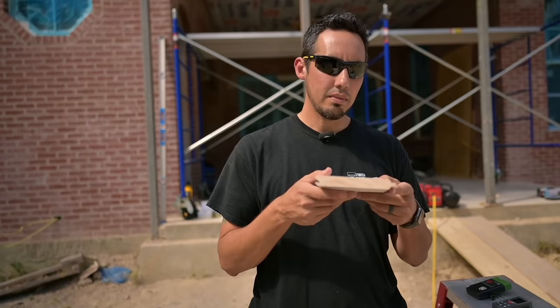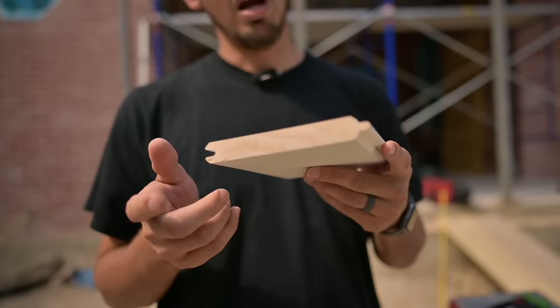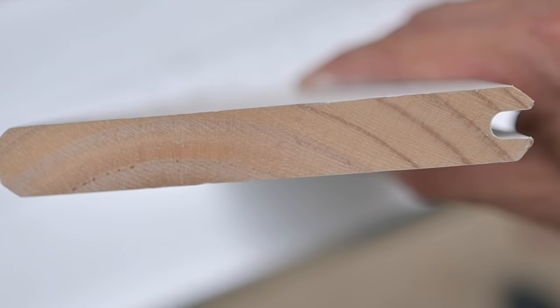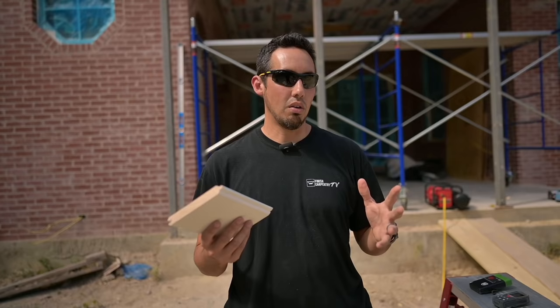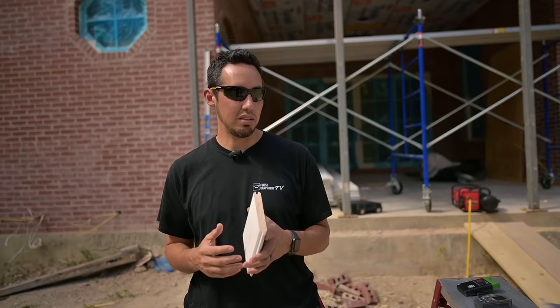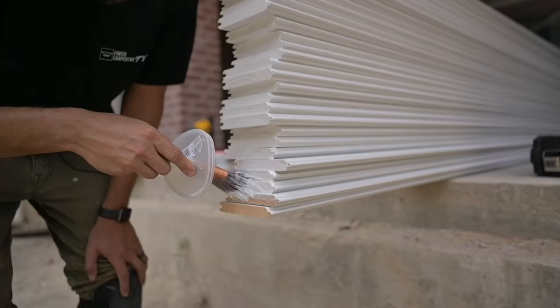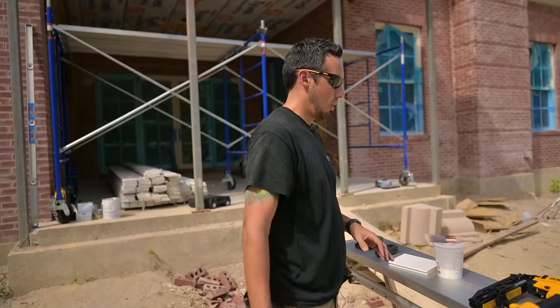This is our material — 1x6 with a tongue and groove. It's treated and primed on all four sides, but when you cut it you expose the raw wood. End grain cuts on this kind of wood are like drinking straws — all those wood fibers want to absorb water. To eliminate that, we use a paintbrush and exterior grade latex primer. Any time we make a cut, we seal off and close up those wood fibers.